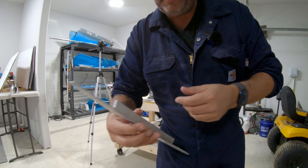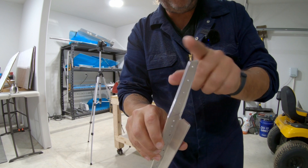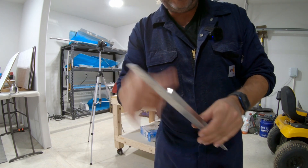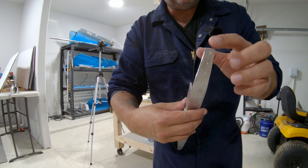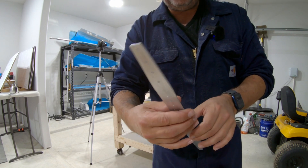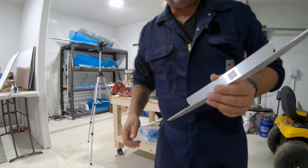This one is coming out better than the last because I've got the right amount of edge distance. I'm going to have to round off the radius — I won't do that with a scotch brite wheel. I think I'll do that with a vixen file to be a little more careful, but I'll chase the rest down to the line with the scotch brite wheel.